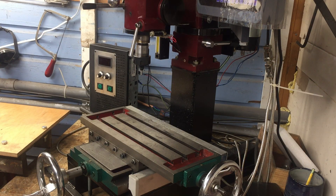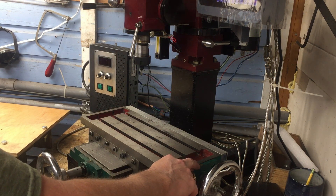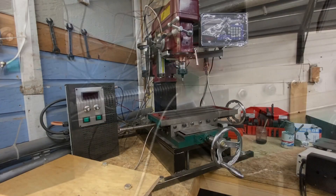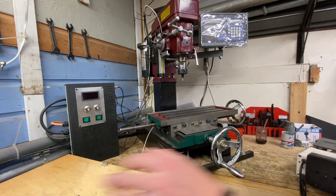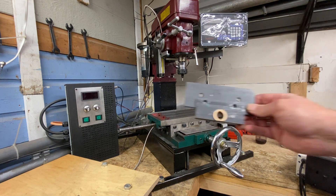The second issue was that the lead screw is only supported on one end. There's a nut in the middle and it's supported on this end, but not on the other end. The result is a lead screw that bounces around — you can see quite a bit of movement up and down. This is not conducive to adding power feed, because this spur gear goes on the end of the lead screw, and if it's wobbling it's going to engage with the gear on the power feed and then disengage, causing noise problems and reduced gear life. My solution to the unsupported end issue is also my solution for mounting the power feed, and that's this bracket right here.